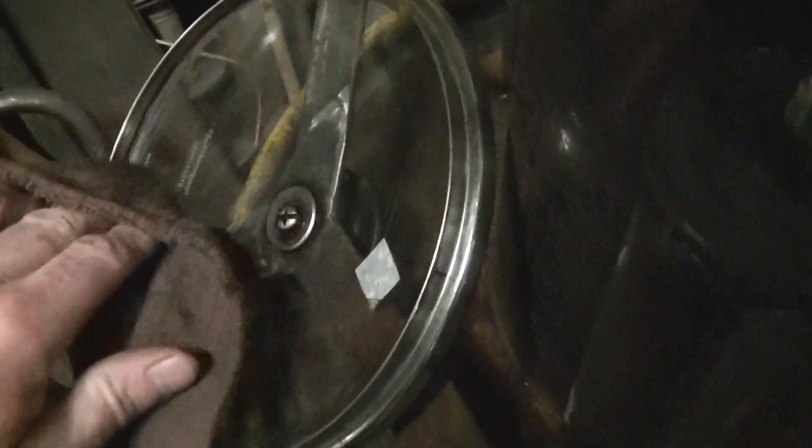When you get bridging and it drops, you get a surge of oxygen or air, and then it kind of puffs back out of the system. I don't recommend looking through the glass lid — I've had a couple of puff-backs go and it's pretty scary with all those hot embers. At least that's what I'm finding.